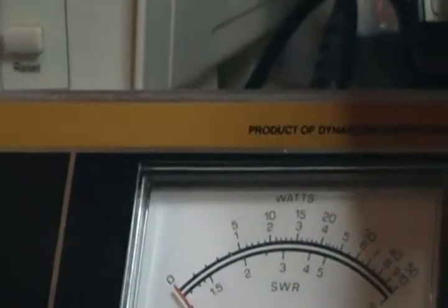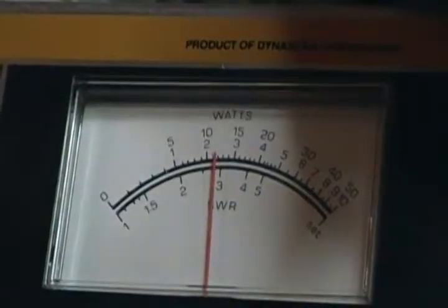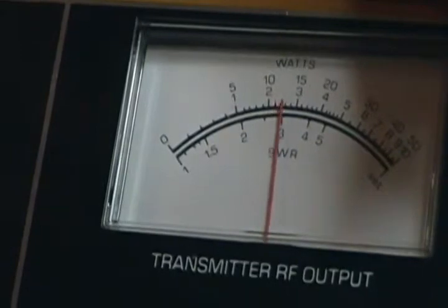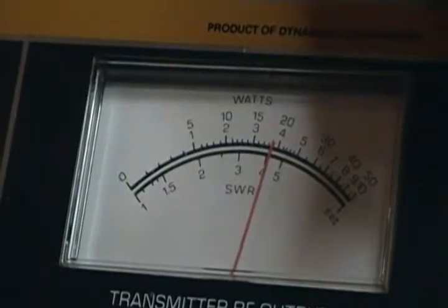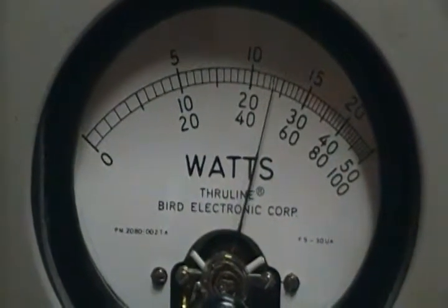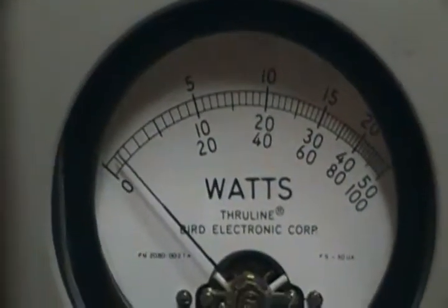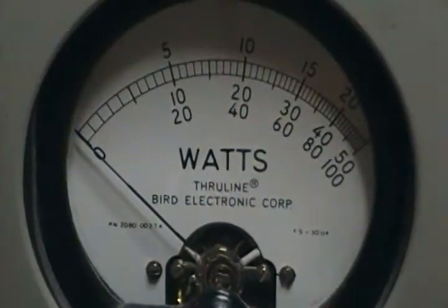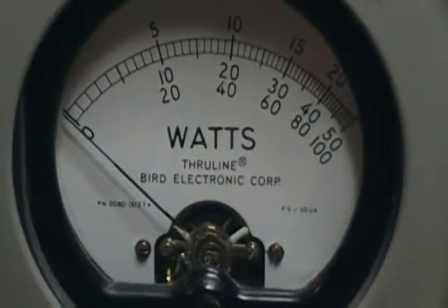So put it up midway, and that's the 10 watt scale. See it just over a 2-watt carrier or dead key, all the way up to max, and you're back up to 4 watts, just under 4. Now, even with it in the middle position, we're going to get pretty good swing. Remember, we had just around 20. Oh, check. So it's pushing up to 25 watts now. So what I'm going to do now is your MOSFET mod, and we'll get her done.